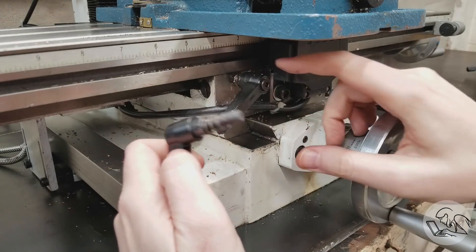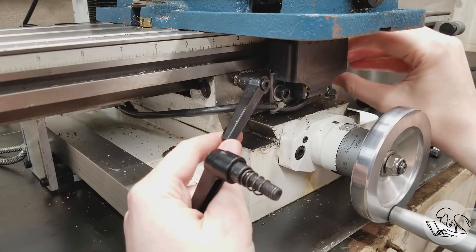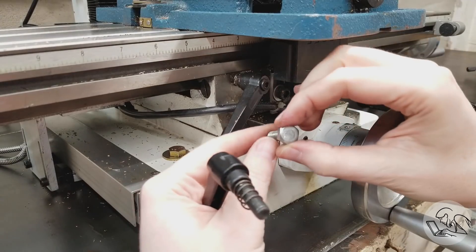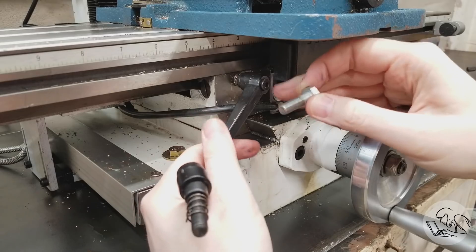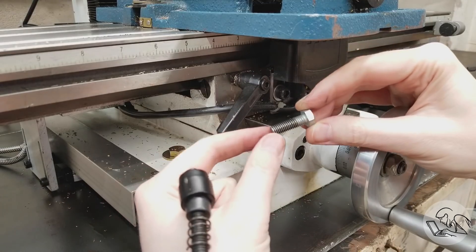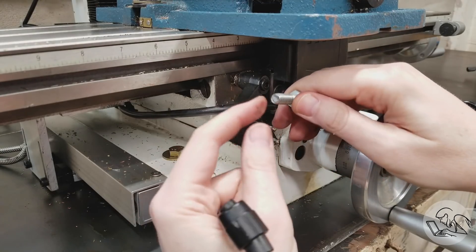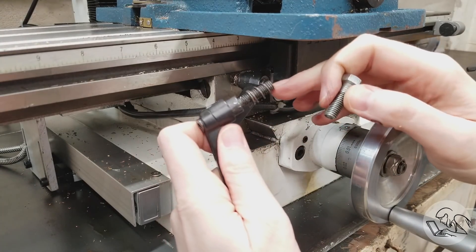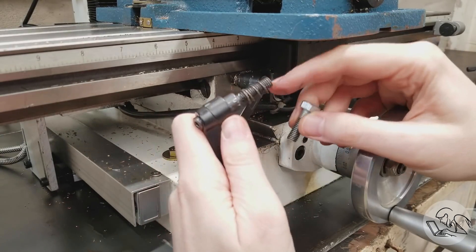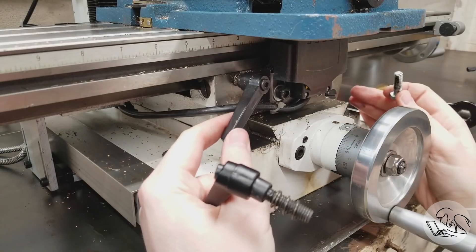What I'm going to do is make a new style of locking device. On the other side I've temporarily replaced the second handle with a simple bolt, because frankly this amount of leverage finger-tight is honestly all you need. This is a small machine — the cutting forces aren't that high; you absolutely do not need three inches of leverage on the table locks. So we're going to make some brass knobs, maybe one to two inches in diameter. That'll also be nice because there'll be brass on the end instead of hardened steel, which I really don't like using against my cast iron dovetails.